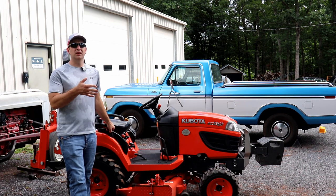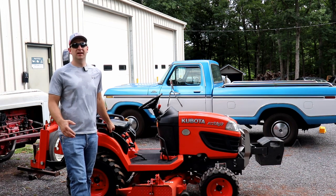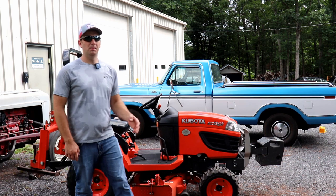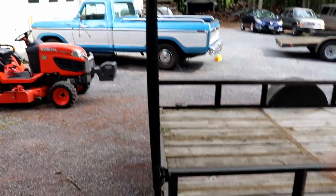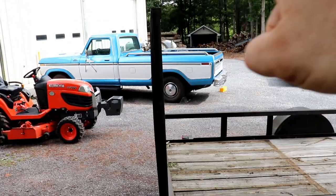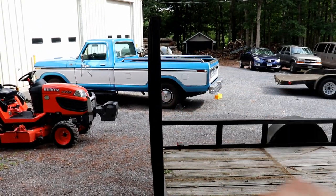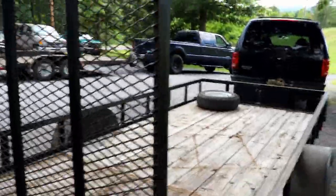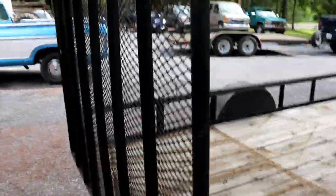The BX is sitting inside the single axle trailer here. Let's see what it looks like on a 14 foot trailer. But before I load it, I want to show you one thing — this gate is actually bowed just a little bit. If you're looking for a landscape style trailer, this trailer has a gate made out of angle iron. There are heavier duty gates made out of box tubing, which would be better, and some of them even have little runners going crossways for extra strength when you pull something heavy on the trailer.